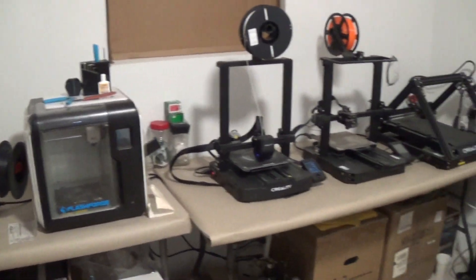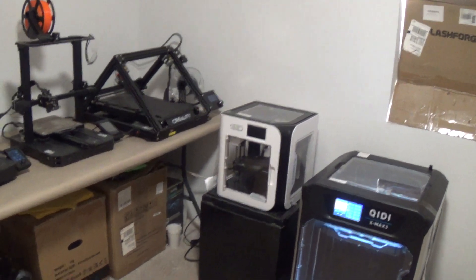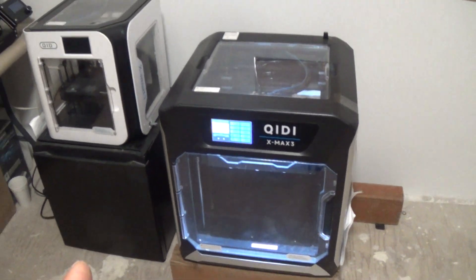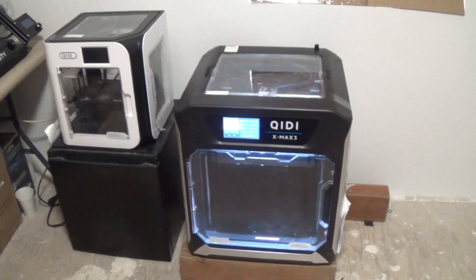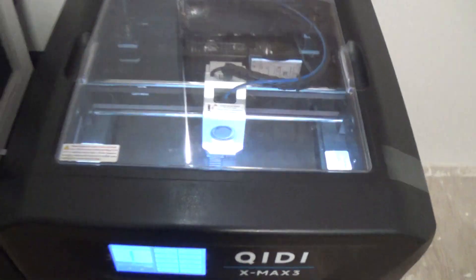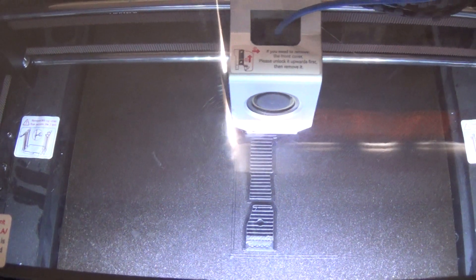There's the seven machines that I've put together here for this show. This should do everything that we're going to need to do — between the belt printer being able to have an infinite Z-axis and print really long items, like some wind blades for a wind generator, and then we have this X-Max 3 over here. This thing is awesome when it comes to producing very strong large parts made out of engineering grade materials like carbon fiber nylon, carbon fiber PET, or glass filled nylons. Right now that's printing out a product — looks like it's doing pretty well. Right now that's printing with a glass filled nylon and you can see just how nice that's doing.